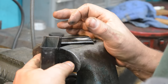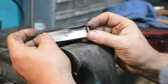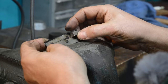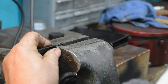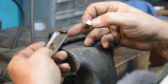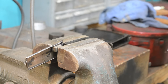If we look on a long axis here, there's a slight bend there. But this isn't what's really going to get me. This was obviously dropped. This was not a piece of spring steel — if you bend a spring, when you bend it back you might crack it. So in our case, not. I'm just going to take a piece of square stock here and attempt to see what this looks like if we try to bend that back a little bit. That took some of the bend out of it. Now we can crawl up in even further — I'm not whacking on this thing with a hammer. This is folded over, so if I do this wrong I'll lose that fold and it won't slide up on the lips of the box here.